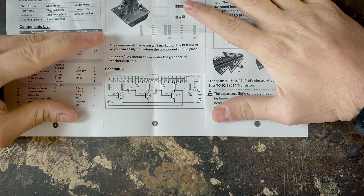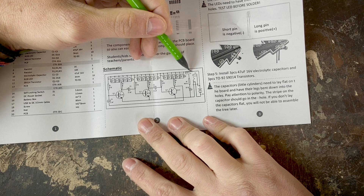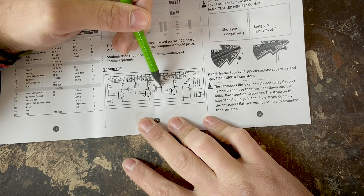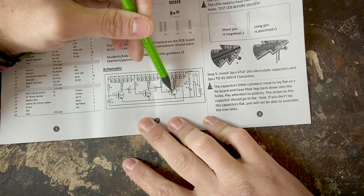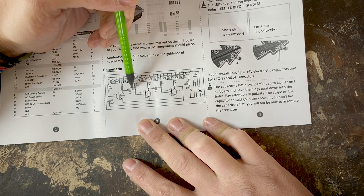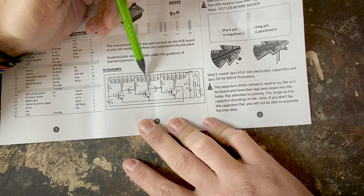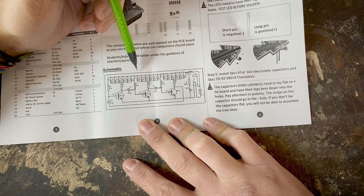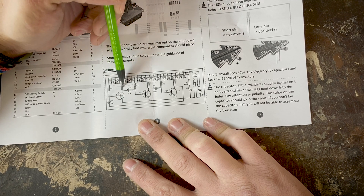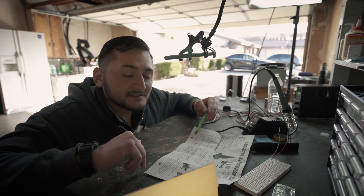This is what we call an oscillating circuit. As you can see, the switch closes the circuit and then we have current flowing through here, which charges this capacitor. As soon as this capacitor gets charged, it opens up this transistor, so all these lights get turned on. You have current going through here, through this resistor, charging this capacitor. And then once it's charged, it opens up the transistor through the base here. Now you have this side of LEDs light up. Then you have the current going through here, through this capacitor, and the transistor opens up these LED lights and then it all goes to ground. It's a very oversimplified view of the circuit, but I just wanted you to know the basics of how it works so that when we turn it on, you at least have some idea of how it works.